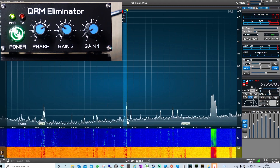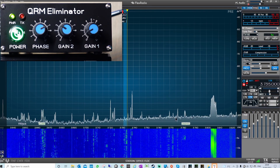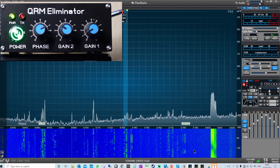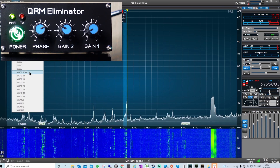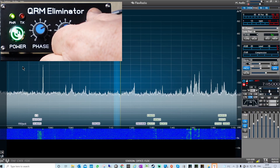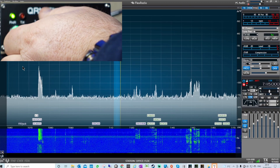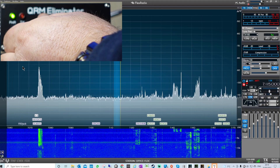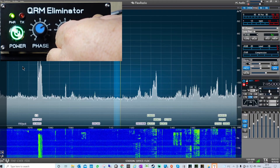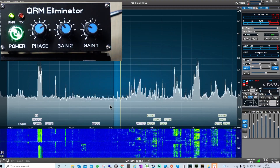I'd love to hear your opinions. I'm sure some people will say, Mike, all you're doing is attenuating the signal — noise and the wanted signal are going down four or five S points. So that was on 40m. 80m is exactly the same for me. 80m is kind of an unusable band because there just is so much noise, but I get the feeling that this is actually making it a bit more usable. To me, those signals look like they're standing out a lot more against the noise, and signal-to-noise ratio is the key. That's what it's all about.